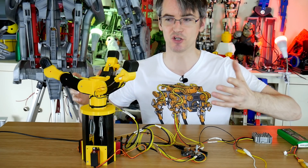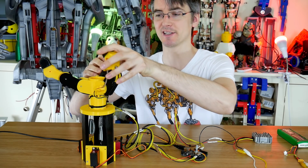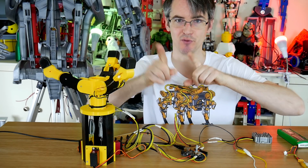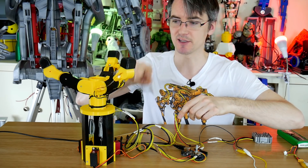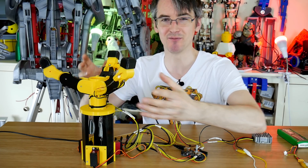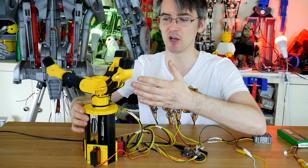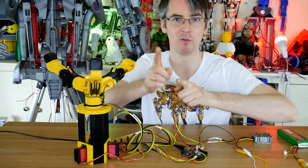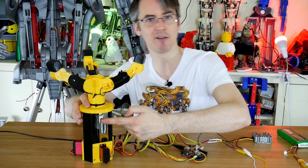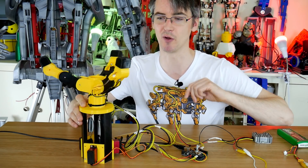So there are a few design things we could change. Ideally, we wouldn't have a joint that requires more force as it closes — so the bungee is not a very good idea really. We want a motor that pushes and pulls with a spring, so as it closes, it's just that same amount of force that would keep closing that joint. Also, these bend sensors aren't very linear in themselves. So ideally, with one joint pulled by one motor, we could just put a pot on it. We can also use a linear pot to measure the other end of the spring and that will give us a better linear answer. I just wanted to test the bend sensors out really for soft robots, as I said.